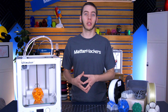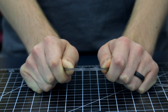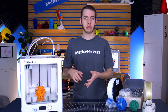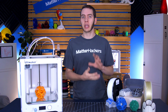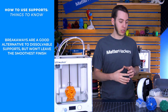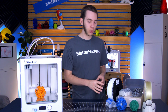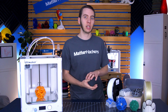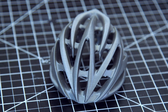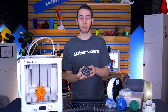On the other side of things, there are breakaway materials like Ultimaker's Breakaway or E3D's Scaffold Snap, which as the name implies breaks away from your print rather than dissolves. These materials work on basically every build material — PLA, ABS, nylon, PETG — they'll stick to them. The caveat is it doesn't have quite as smooth a surface finish as if you had used a dissolvable. So it's really nice if you don't have something with a lot of complex geometry. For something like this bike helmet, which doesn't really have any internal geometry or places where you wouldn't be able to get pliers into, breakaway or snap material is not a bad option.